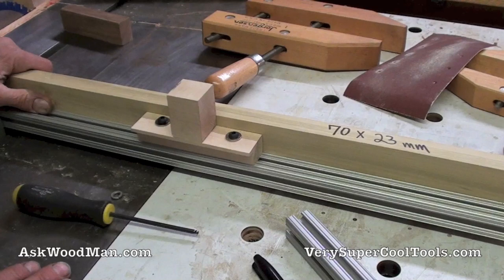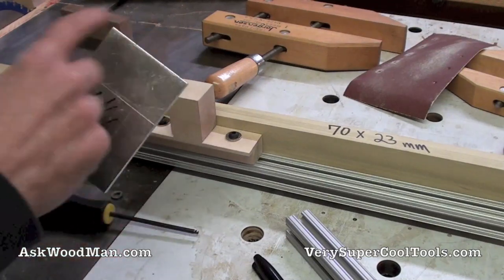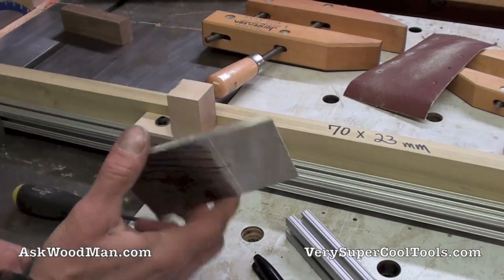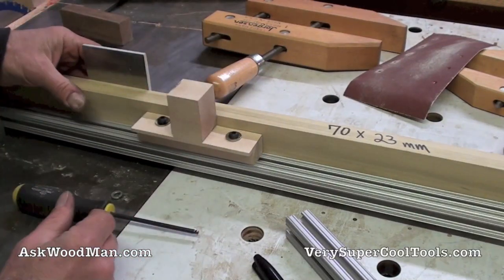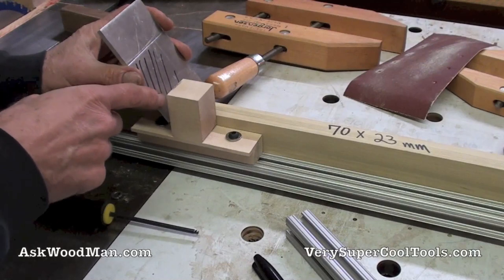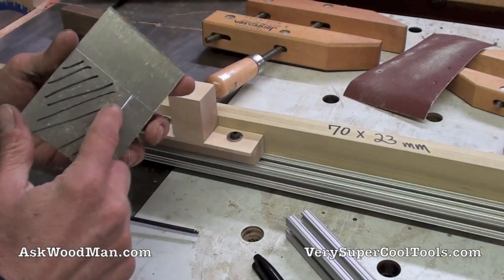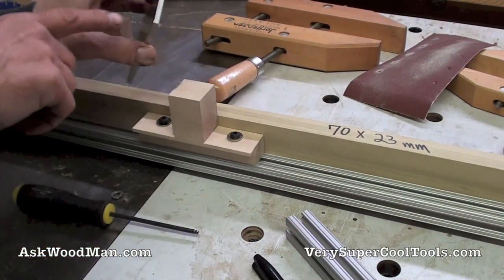I squared up this piece of aluminum from my scrap pile — it's 6mm aluminum. I'll sand and clean it up. I scribed my line at 70 millimeters, positioning it so it's flush with the front of the fence. All I have to do now is cut this out with the porta-band, then place it and decide where the hole is going to be.